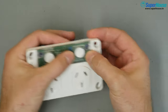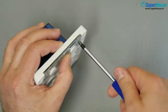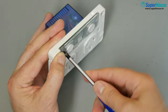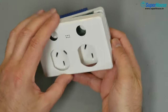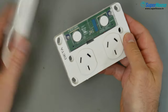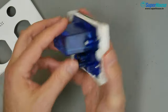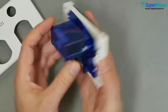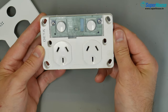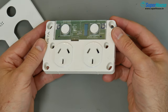Drop in the transparent cover and put the screws back in place. You can put the cover back on if you want to if you are not going to be installing this any time soon, but of course you will need to leave this off in order to screw it onto the wall. This will now be fully functional — when you power it up it will connect to your wifi network with the settings that you configured, and Tasmota will be set up with the correct device settings so it will function exactly as you'd expect.